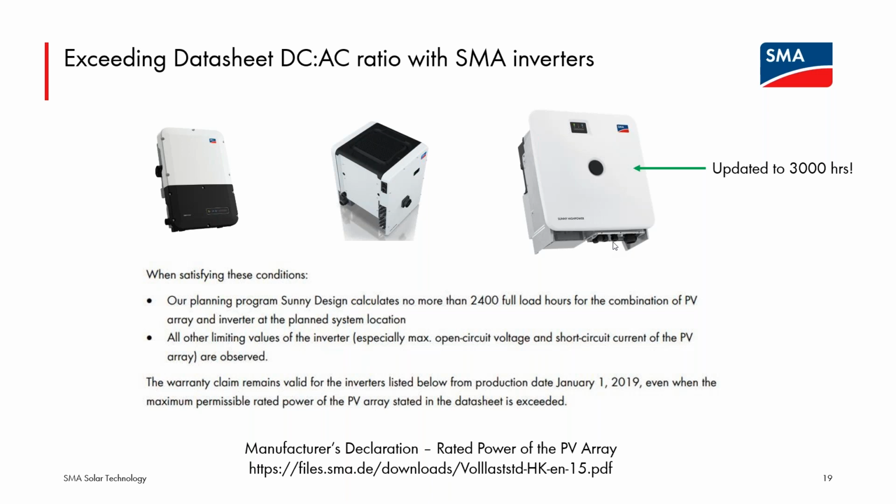And Charles asks, is there any data surge protection devices for the Core 1s where the Cat5 cables plug into the comms board? No, there is not an option to add anything. I believe you can see in the install manual for the Core 1, I want to say we have listed up to 1.5 kV protection, but anything beefier than that, definitely SMA doesn't have a standard accessory to purchase to protect that comms line.